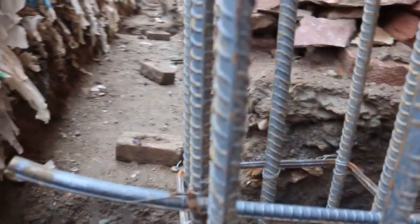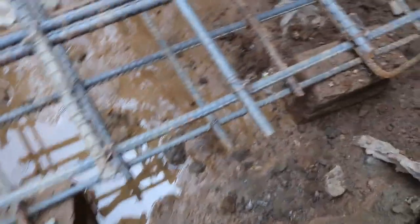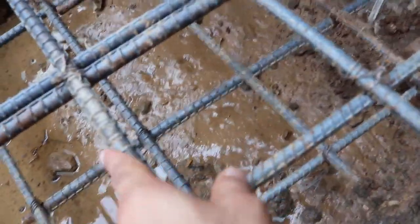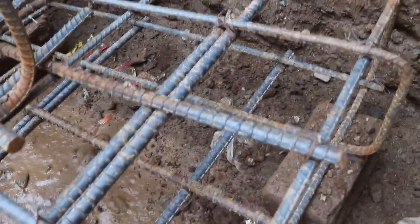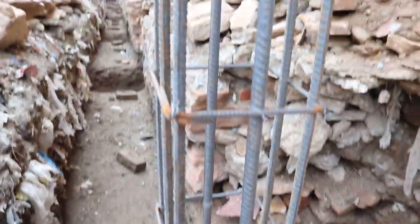As you can see, we have 8 steel bars of 20mm diameter here. You can also see the footing reinforcement details and the concrete cover — it is about 9 inches on each side, which is not acceptable. They used 12mm diameter steel in the footing with 6-inch spacing, which is okay, but the depth is insufficient to support the structural load.